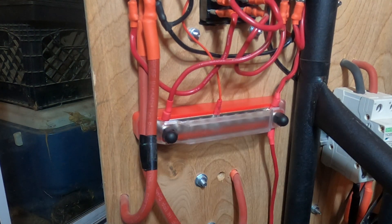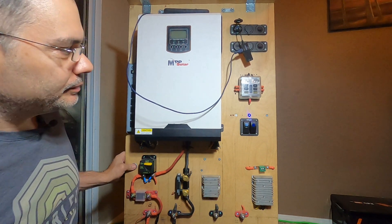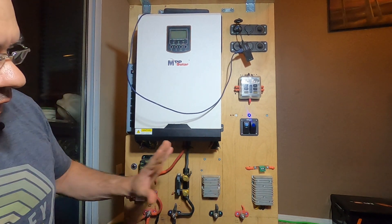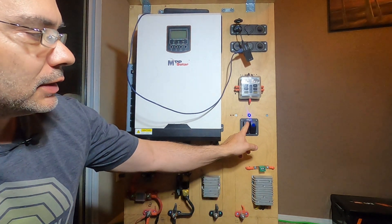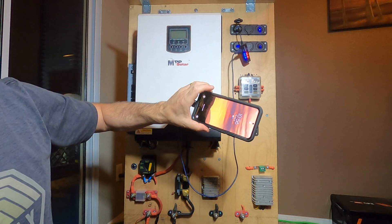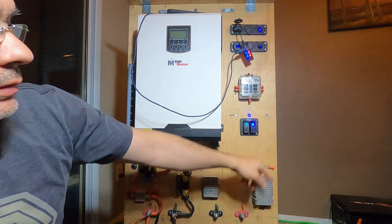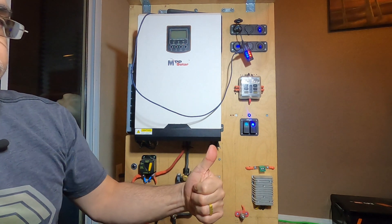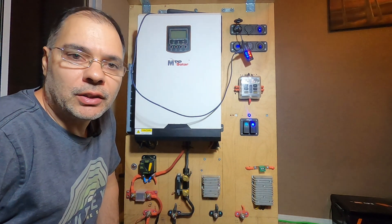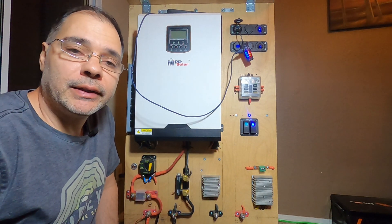Let's turn it around and fire it up and see if everything works. First we'll pre-charge it — okay, our light's on. Flip the breaker. Now we got power. Turn on our DC side. Cool, it's charging. Phone's charging. Very good. And let's see if this switch works. Very nice. So I'm going to update the circuit on my website — in case you're interested, it'll reflect the new wiring diagram with the bus bars. So yeah, that's it. Thanks for watching.